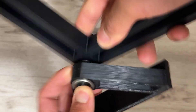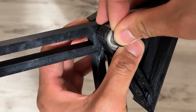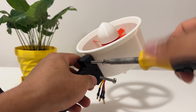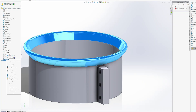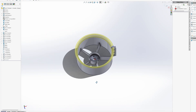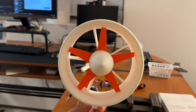First and foremost, I really have no clue if my thrust testing method is actually valid. It's really only useful for testing my designs against each other on the same setup, which I have done in the past, but I think the way I accelerated the fan super quickly probably means this lever scale method is an unreliable way of testing thrust, especially now that I'm producing some crazy vibrations. Regardless, it's a huge advancement in my ducted fan journey — I've doubled my max thrust, and this was with a fan and inlet lip I threw together in like three minutes. It felt like I hit a plateau with the 70 millimeter version, but scaling this project suddenly made it a lot more viable. As always, let me know what you guys think — if you have good suggestions, I'll more than likely put it in my next iteration.